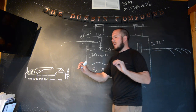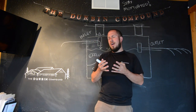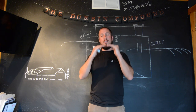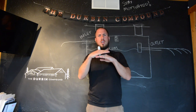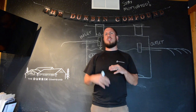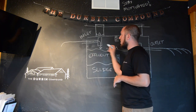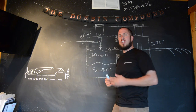The scum on top is that filmy layer that just floats — oils and things you put down the sink. Think of it like an oil layer on top of water that looks foggy and you can't see through it. When we go outside, I'll show you exactly what the scum layer looks like, and you might see some solids sitting on top waiting to sink down into your sludge.